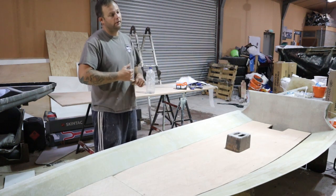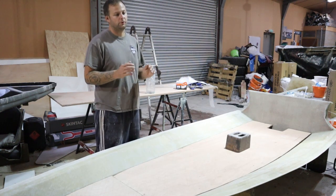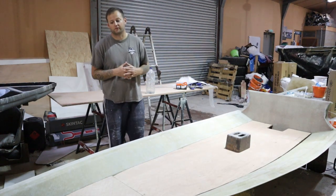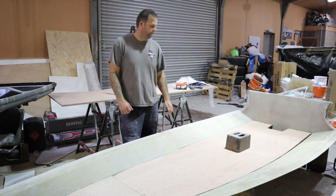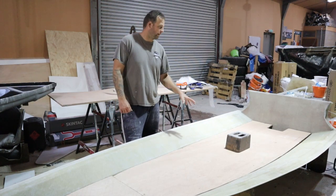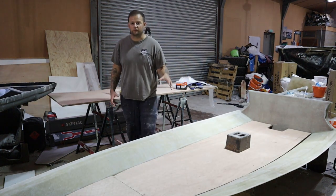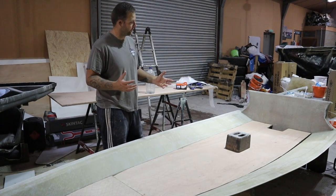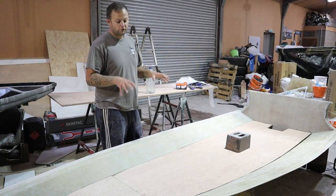Now you can use that bonding compound. There are some other products available, but really you want to go with something that's going to have some sort of structural integrity to it to help hold that. Because this boat has no longitudinals, no stiffeners, no framework underneath the deck skin, because it's such a small boat, the deck is actually keeping the shape of the hull intact, okay? So you just don't want to just float this in there.